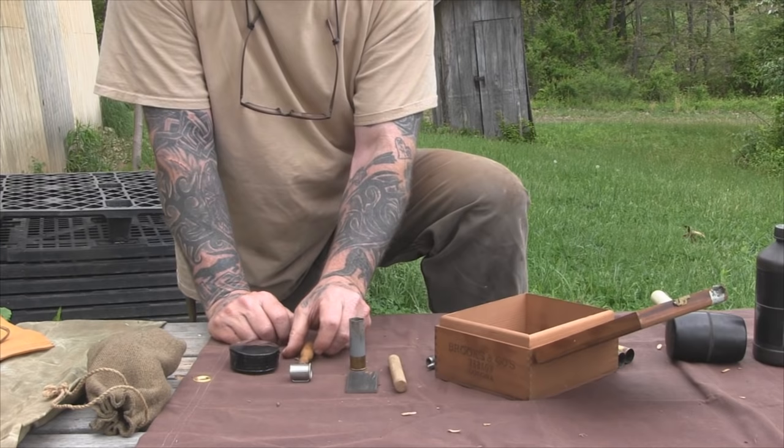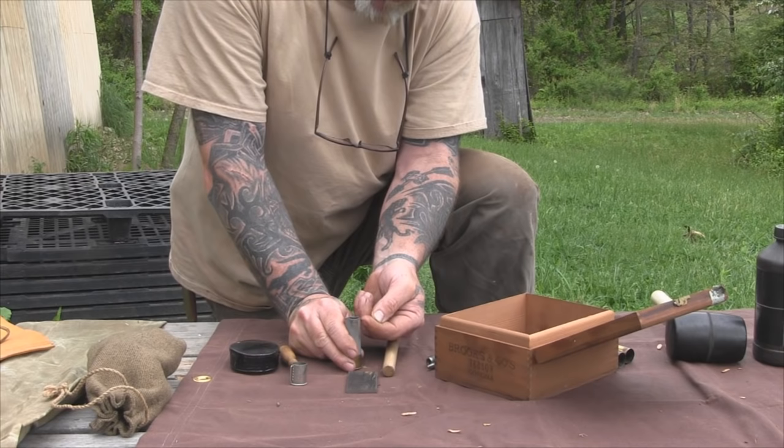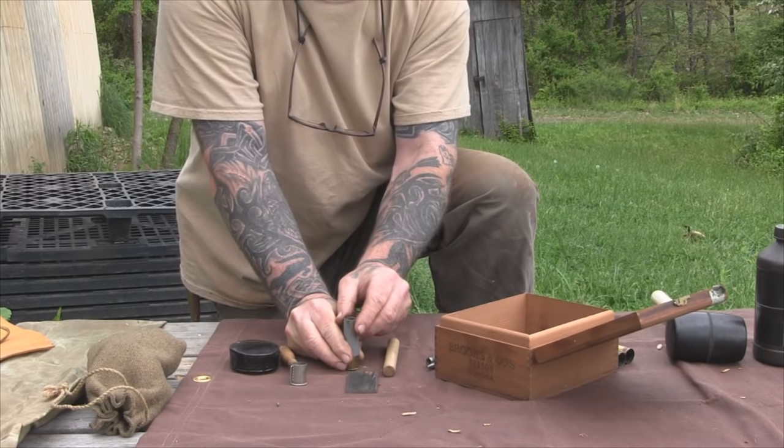And then I'm going to use enough wadding to bring that, after it's tamped down, to almost about an eighth of an inch below the bottom of the shell. And I've trimmed the crimp off the shell on purpose because I'm not going to re-crimp the shell. And once I get that in, I'll put an overshot card in here.